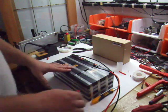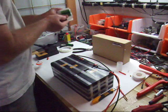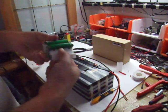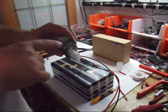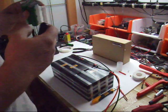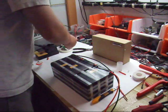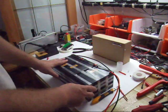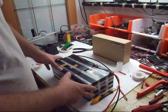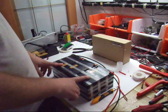Lead-acid cells are nice and tough — you don't have to worry about hurting them. When you want to solder to cells like this, compare that to lithium 18650 cells, which are spot welded because the cells are kind of fragile. They're jelly-rolled and the materials of the cells are right close to the tabs. Lead-acid batteries, the manufacturing process involves a lot of heat and these are not that fragile. You can take an iron and safely solder to those and never have a problem.